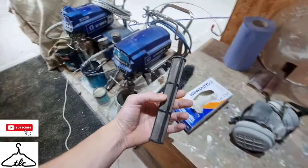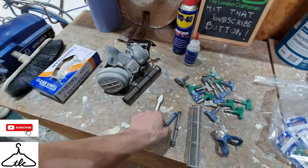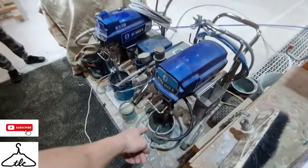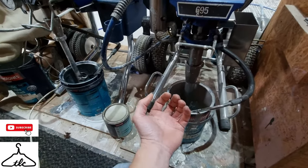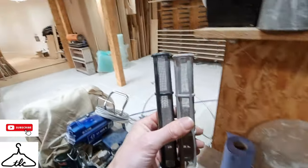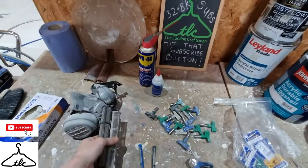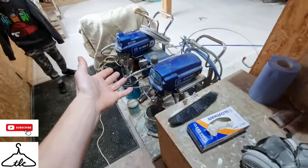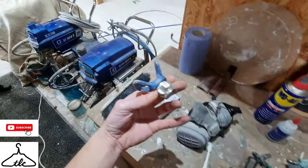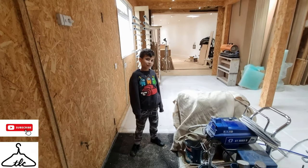You're going to want a selection of filters. These machines have three filters — one goes in the manifold, one in the gun handle, and one on the end of the intake tube as a strainer so it doesn't suck big bits of paint. Keep spares just in case. They come in different grades — silver, black, and blue — depending on your application. We've also got a spare guard for the end of the gun. Always good to have spares.